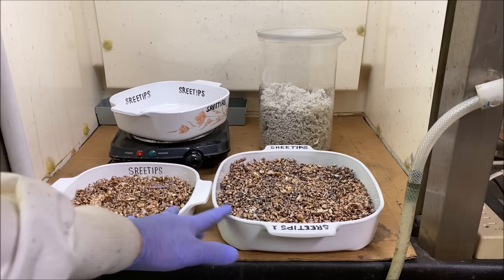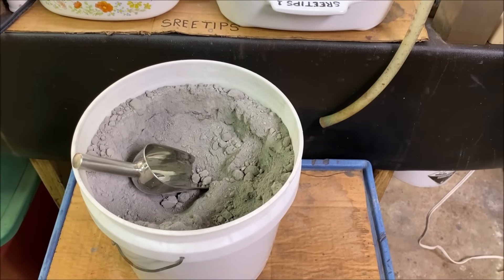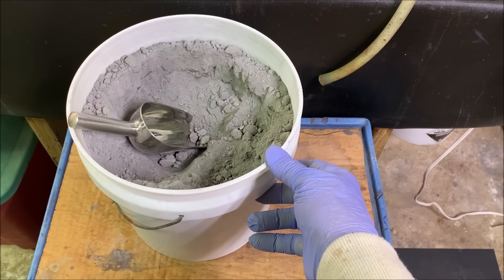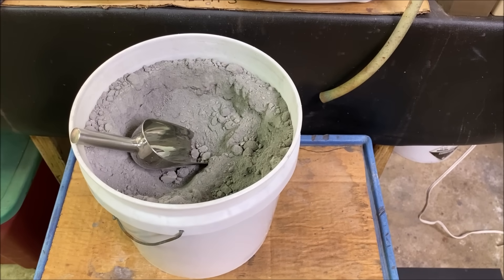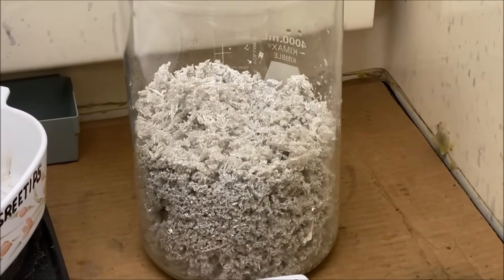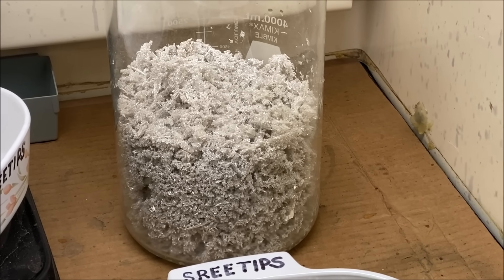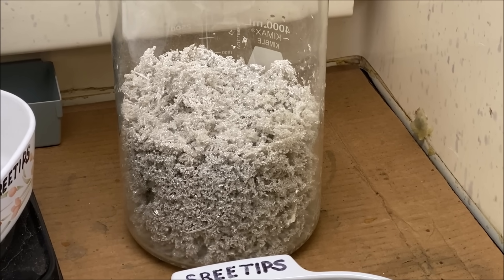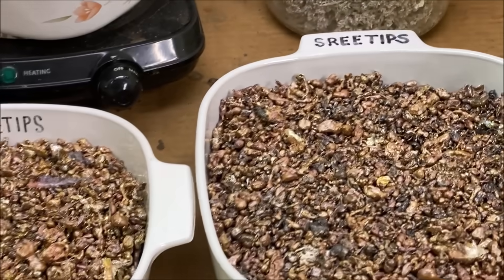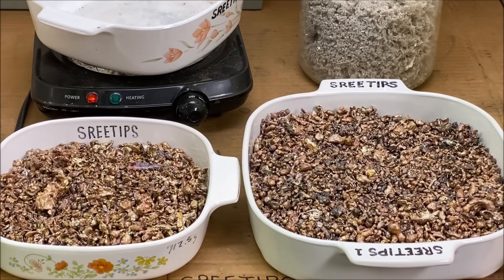This is what's left in our bucket — made a pretty good dent in it. I'm going to have to come up with an alternate plan, maybe break out the big furnace and do a melt with the big furnace. Back there, if you look, I've got some pure silver crystal from a previous harvest. In the next video, I'll make the electrolyte using that pure silver crystal for the electrolytic silver cells, and then we'll run this impure silver shot through the silver cells. Okay, this will conclude the video — thank you for watching.